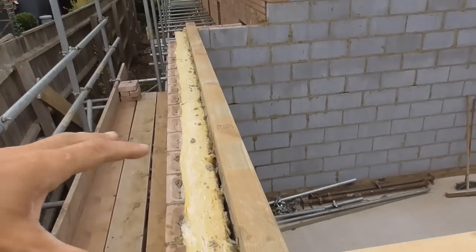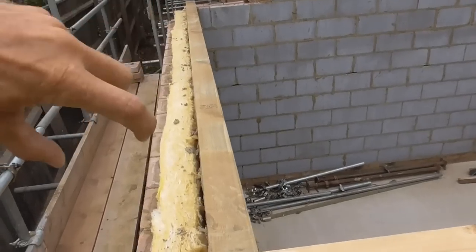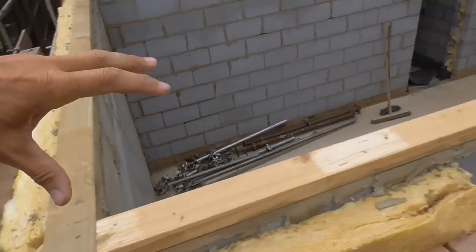What I've done is I've half lapped these plates on here. I'm not going to do a full in-depth video because I think I've done enough with that one. We're going to start to finish. Interestingly, although it's cavity wall construction, so 300mm wall build up: 100mm internal skin, 100mm insulation, 100mm external skin.